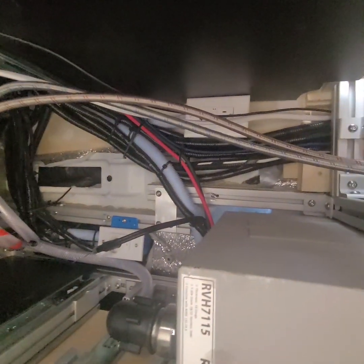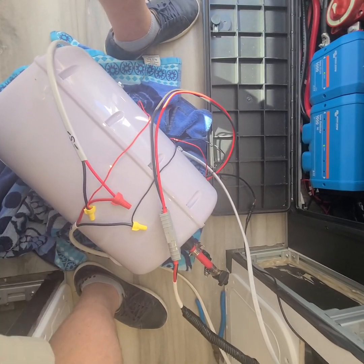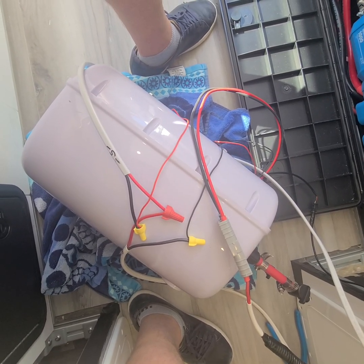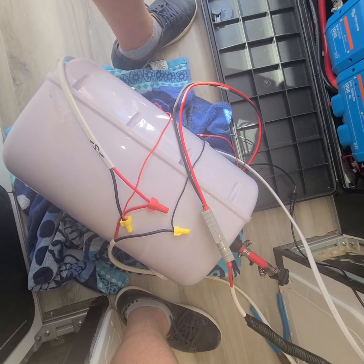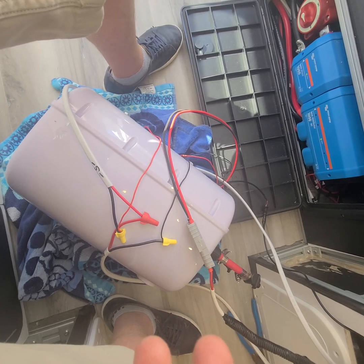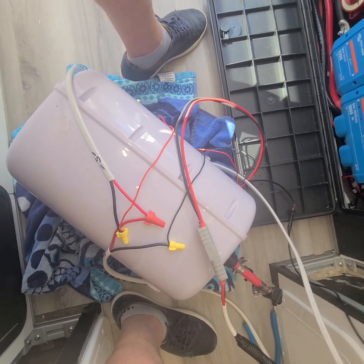Since we're in the States, a plug like that is going to be 120 volts. This is inside the van — that was actually the plug for my previous water heater. This one's got a lot better space usage, so more efficient with space, so I'm going to use this one. Regarding the documentation, first of all, it calls for a 50 amp, 12 volt circuit — which is ridiculous. 50 amps — ridiculous.